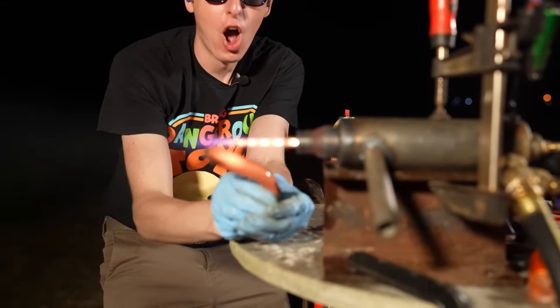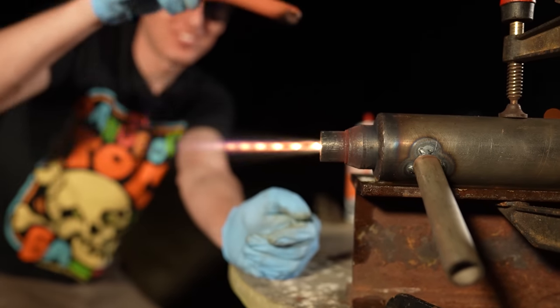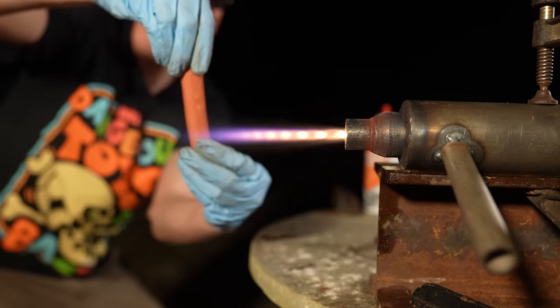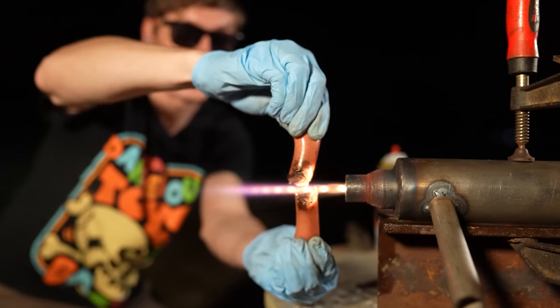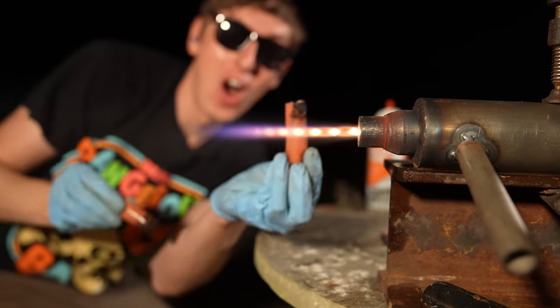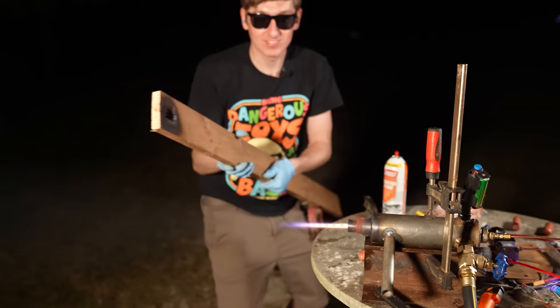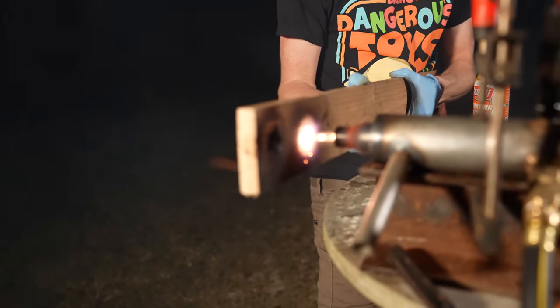I mean, the hot dog and the rocket exhaust are acting like opposing magnets. Just trying to push it into the exhaust wouldn't work at all, so I had to grab it on either side and slowly bring it into the flame. And I've gotta say, these shock diamonds look so cool, and I was super excited to see them just persisting like that. Switching to kerosene really made a difference in how bright the exhaust was too. The propane was just a little bit too pale, but one downside of kerosene is that it makes a lot of smoke when you run it too rich.